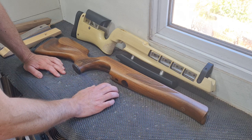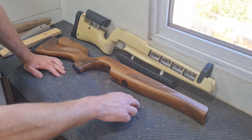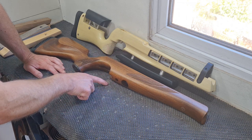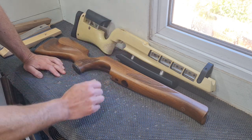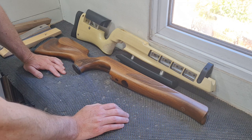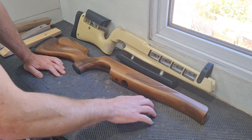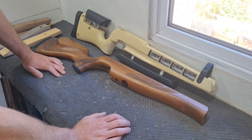If you're a fairly big fella you probably don't necessarily want to come right down to that maximum depth. If you're taller and skinnier you may find it's more beneficial to bring it nearer that limit. I'm 5'7", fairly skinny - I tend to prefer a hamster around 120mm to 125mm overall depth. I don't like to go too deep as it tends to make the guns feel a little bit top heavy, but only you can really decide that through trial and error. Get out on an HFT course, get a few shoots in, and it would be worth having a few additional bits of material for your posts in case you need to fine-tune after a test session.